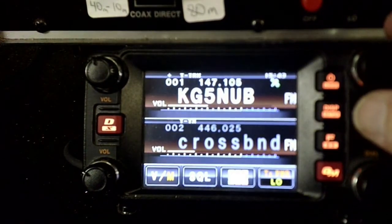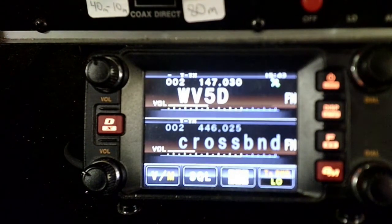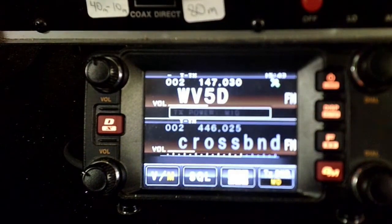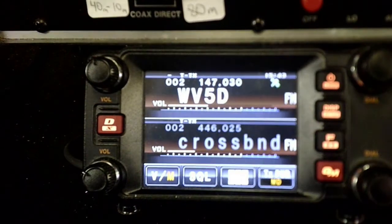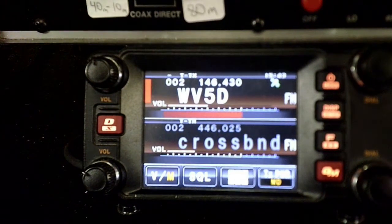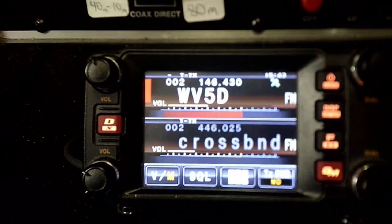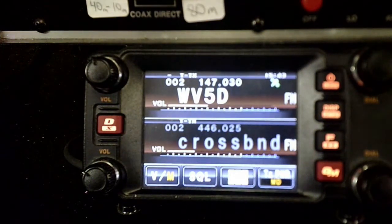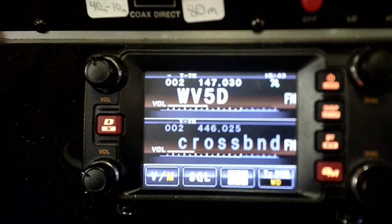Sorry about that, I spiked the mic accidentally. Let's go to our next repeater. Next channel up — this repeater is about 18.6 miles. I normally operate this repeater at medium power. Let's try this one. This is AI-5BL, I am testing an antenna. All right, so you see there I got about half scale on it, working that repeater at 25 watts.